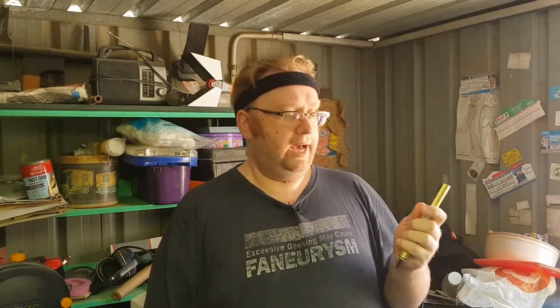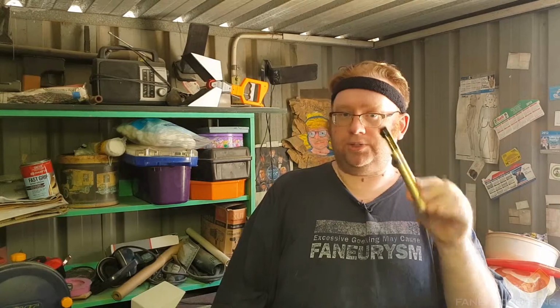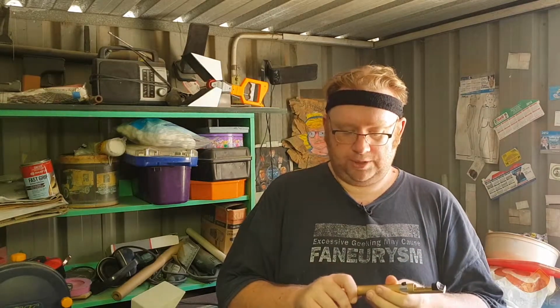And yes, this is just so much fun to use. Now, if you can afford it, or you are genuinely interested in doing this a bit more than just once or twice, get a metal solder sucker. I've had a plastic one in the past. They jam up far more regularly, they will break down, and this is just a lot better.